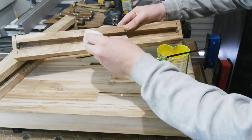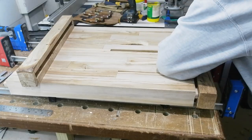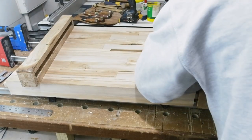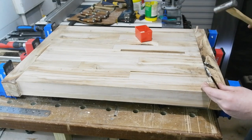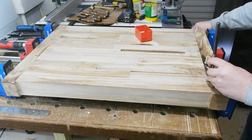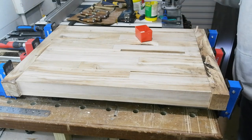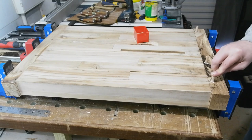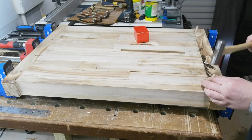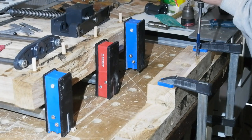In terms of glue, my front fixed dowel position is glued right through. Where the dowels have elongated tenon holes, I just put a drop of glue in the halfway-through hole inside the mortise, clearing the mortise itself of any glue before fitting. End piece tapped in place and drill marks lined up, I tap the dowels right in — these are your standard off-the-shelf ones, about 40 mil long. I use a punch to make sure they're right through, then add a bit of glue in what remains of the hole and sit another dowel on top to plug it.